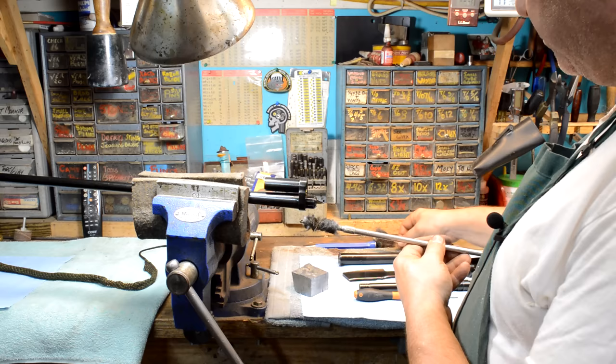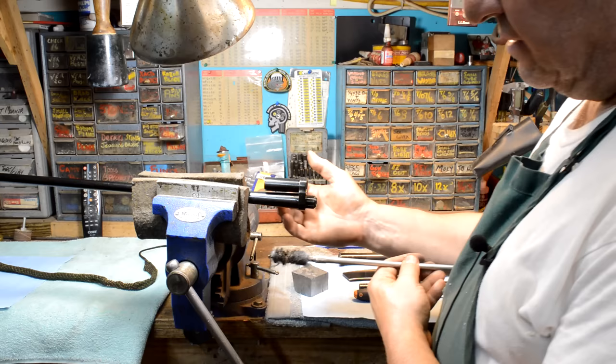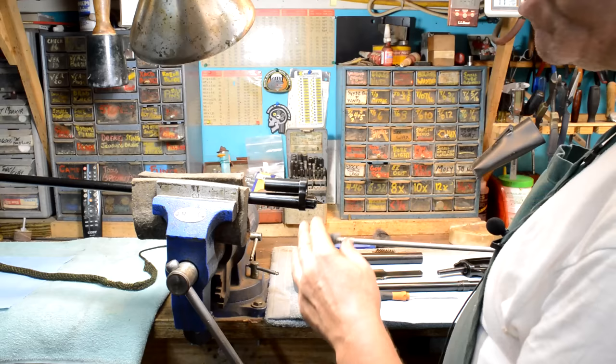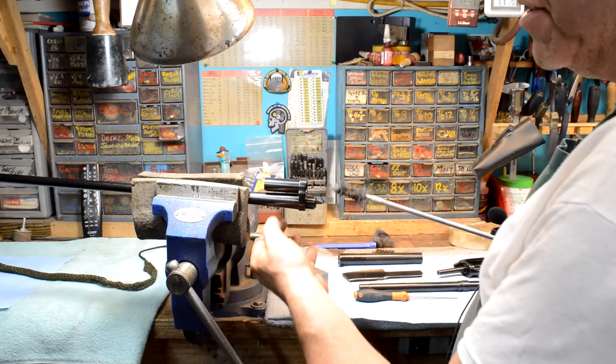So I get asked, how do you card the inside of the barrel? You card the inside of the barrel with a brass bore brush or a bronze brush. In this particular case, we had a lot of corrosion inside the chamber here. It is important that whatever you put in here has to be softer than steel. Do not take a stick, roll some crocus cloth up on it, and run it in and out of here. If you change the dimensions of this chamber, you will ruin the gun.